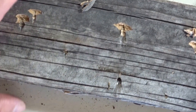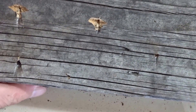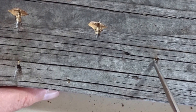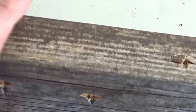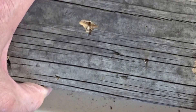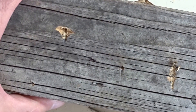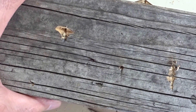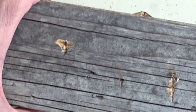One of the problems with fungal decay is that by the time a trained specialist can detect it under a microscope, the wood has lost possibly as much as 50% of its strength. The way that the fungus attacks the wood is very stealthy and very dangerous. Wood decay is nothing to take lightly.